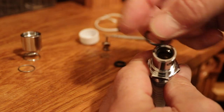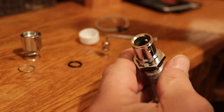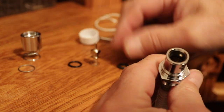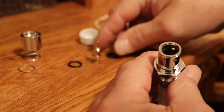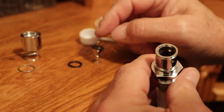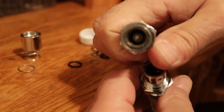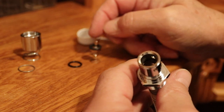Around the edge first is an O-ring and it just comes right out if you use a little small pick. Then in the bottom you have this setup — it's a spring and a check valve and an O-ring that sits on top like that. To get it out you push down with a small screwdriver on this valve which is inside, and then the best way you can do it is to work this O-ring out.